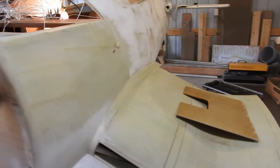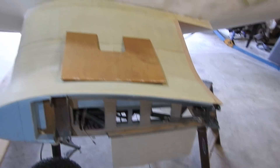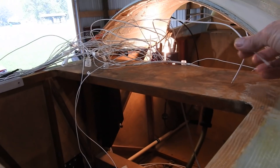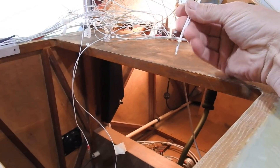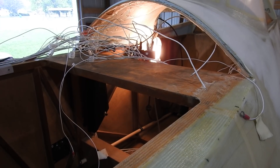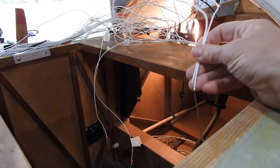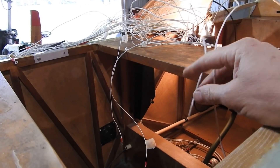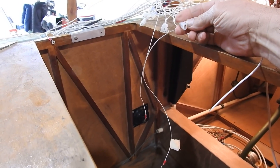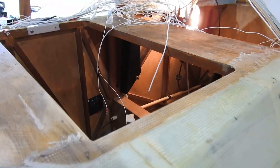A lot of work. Now that the flaps and the gear doors and basically all the wiring is almost finished, I need one more heavy plug to hook up these two fuel pump wires and the ground wire. These will snake underneath here because the tank sumps down under here. The battery died on me mid-shot. Anyway, these two and the ground wire will hook up to another Molex connector — I need to get a higher current one, it's got to be able to withstand about 15 to 20 amps. I've got to get a three prong and fix that up and then that'll be done.